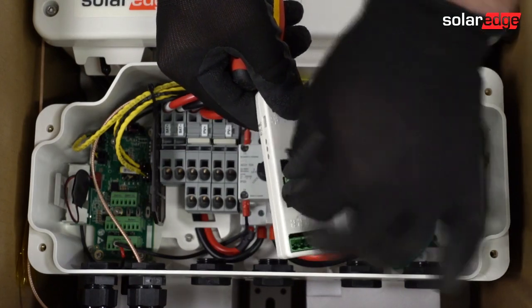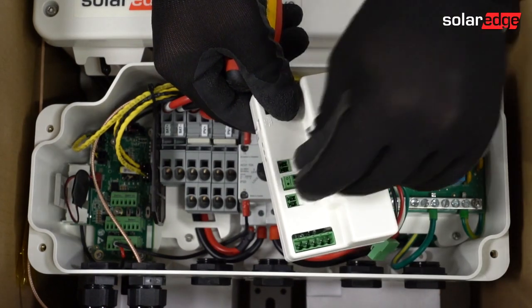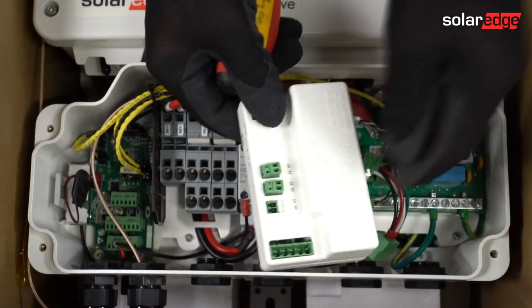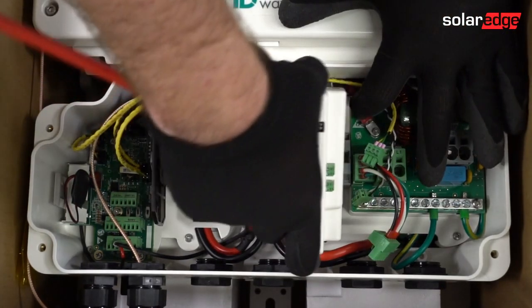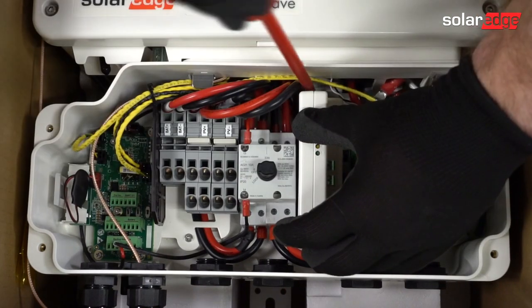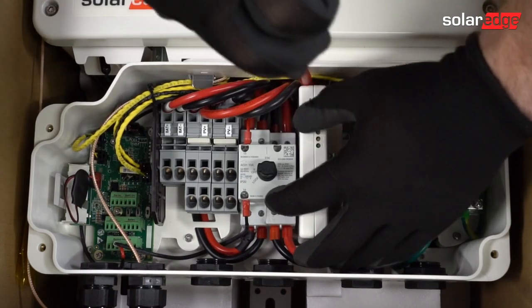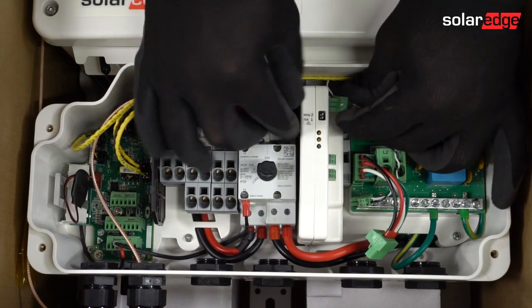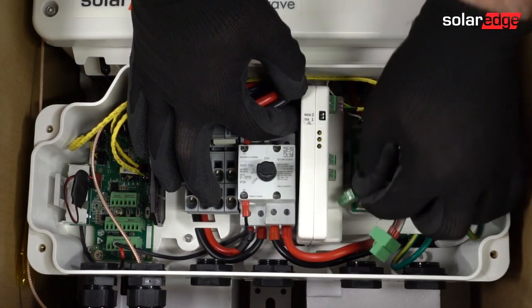Install the CT Phoenix connectors in the PCS Meter. Reinstall using your flat-head screwdriver to secure the DIN rail clip. Reinstall the Phoenix connectors for RS-485, production CT, and power.